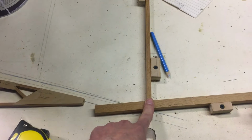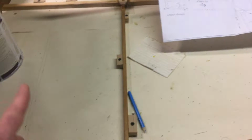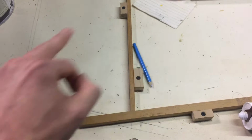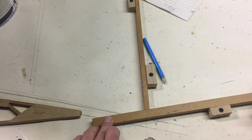I would strongly advise anyone who is doing anything like this, in hindsight, when you loft up your plans, close the loop. So if I had lofted this up to the front, back, put the rib in position, before I started gluing things together. In other words, if I'd created a continuous and complete fuselage side, ensuring that everything worked before I'd glued that back together, then we wouldn't be in this place. So there we go, learn from that.